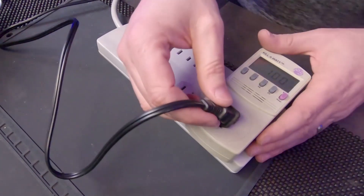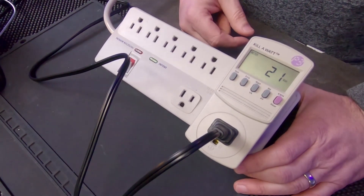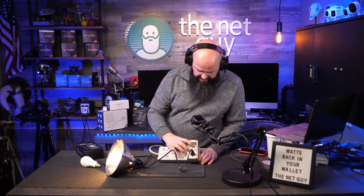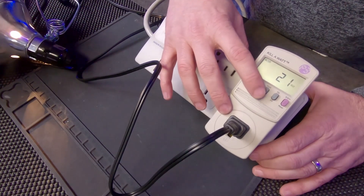So that was an LED light pulling six watts. I've actually got another bulb here — this is a 25-watt incandescent. I'm going to put it in here and plug it in. Now this is actually going to use more power and it's not going to use it as efficiently. Some of that power is being turned into heat, so it's pulling 21 watts even though it's a 25-watt rated bulb. Notice how you can actually see the bulb because a lot of that energy is turned into heat. You can see the power factor, what the watts are, and what the volt-amps are — it's at 21, dropping to 20 occasionally.